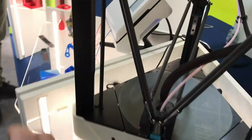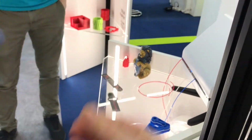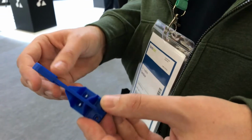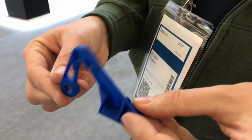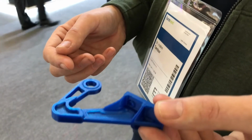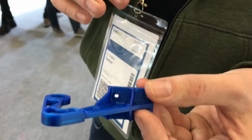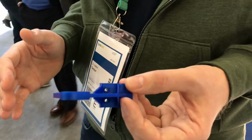What is this exactly? It's a mechanical arm? It's a bracket, where you fix it to a surface this way. And the beauty of this print is that it would not be easily printable without supports. Not at all. Here you can see the surface is really beautiful from both sides. You can't tell which one had the support. And the beauty is that you don't have to use soluble. We are using these peel away supports, which work beautifully, and they're so much more robust to work with.